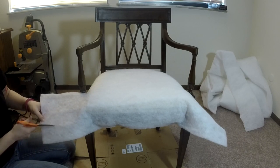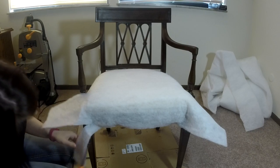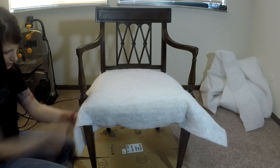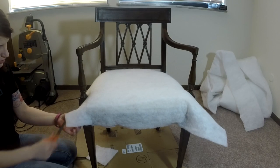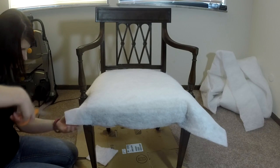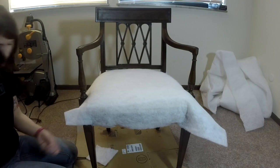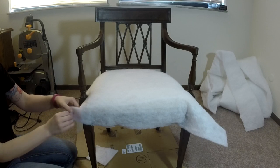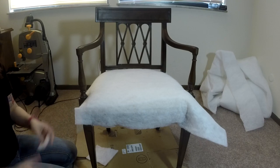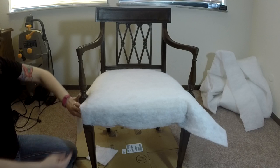She's lining it up with where the actual chair leg starts — basically where the staining is finished — so that the padding doesn't leak out underneath. Keep it flush. Cut out the excess so it's not lumpy underneath the upholstery, because that's where you're folding it over. If you put too much there you're going to have a huge pillow on the side. She does a good job getting it all there and just staples it down.